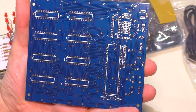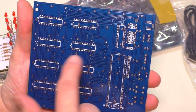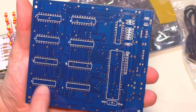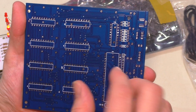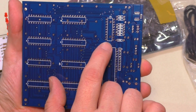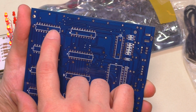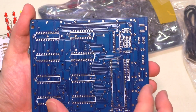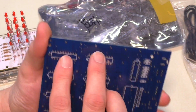If you want to just conceptualize this, this big chip is basically outputting to these smaller chips, and these are what's controlling the LEDs, at least one leg of them. And then the other one over here is controlling the other leg. This is the Darlington chipset, we'll call it. This is controlling the negatives. These are controlling all the positives. On this side over here, there's 8 connections going into this, and then each one of these is also getting 8 connections because of how many LEDs are here, or maybe even more, actually. There are quite a bit of these here. You figure there's 8 layers.